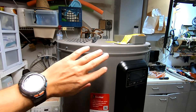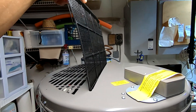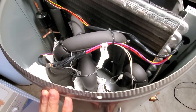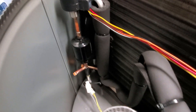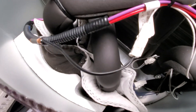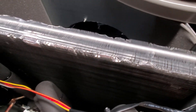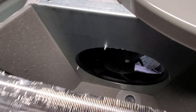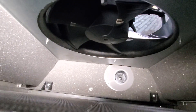The heat pump on this water heater has a filter, just like in an AC unit, so you need to clean this periodically. Here's what is inside the heat pump on top — there's a compressor, a coil right here. I don't know why it's bent like this — I'll have to straighten those. Then we have a fan that's going to blow out the cold air.